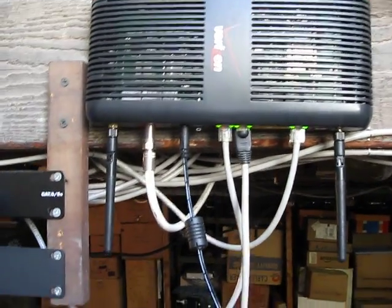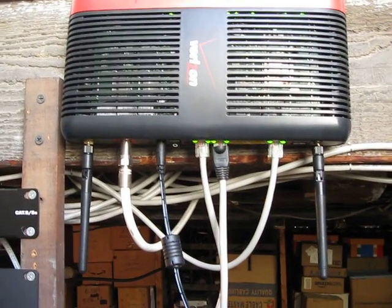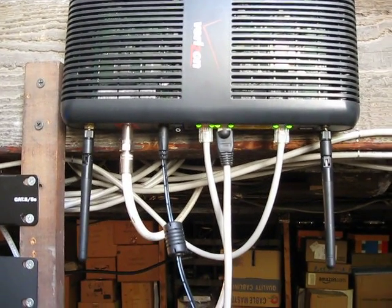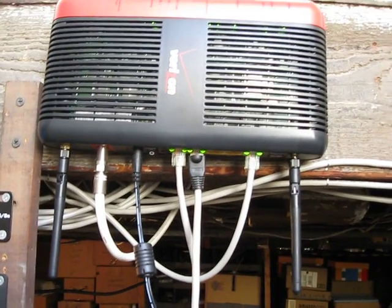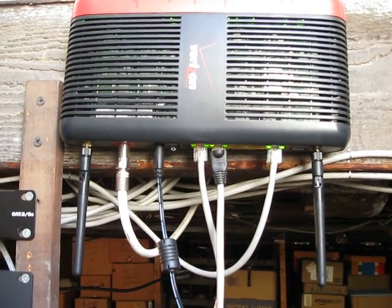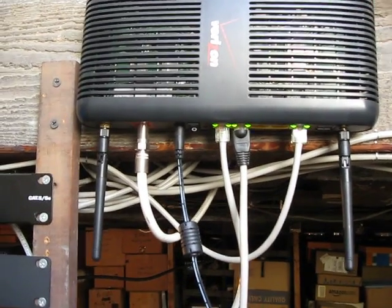Main things to keep in mind: to get Fios, your phone service is tied into the system, which is the best way to do it. But in the case of a power outage, you only have about eight hours before your phone will go out, because that's how long the battery lasts. Also, wherever your ONT is going to be — inside or outside — there has to be an outlet close to it. I put one in myself, but I wouldn't recommend that for just anyone, and electricians are expensive.